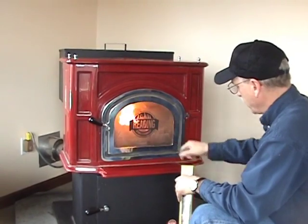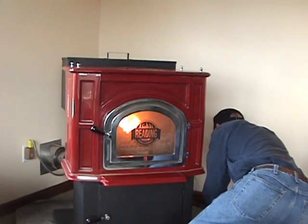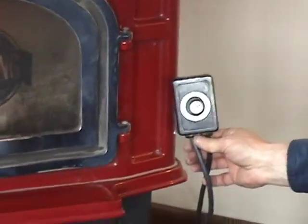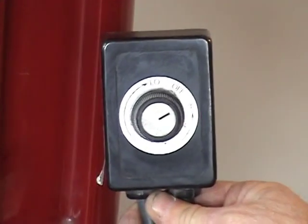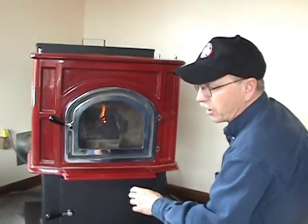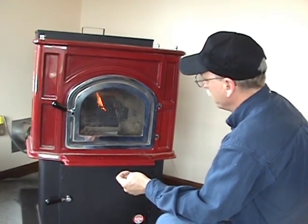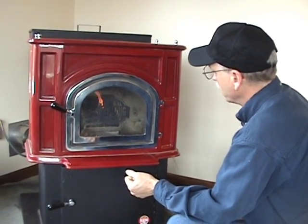Once you see it flash, now you're ready to start the stove up. Go to your rheostat feed, or if you have a thermostat, whatever type of control system you have, you turn it on so it's at maximum feed — not so much for the feed but for the maximum air flow. The air coming up through the starter is what builds the temperature up to get the carbon in the anthracite lit. Carbon burns at a very high temperature, so you have to have something to light it to get it going.